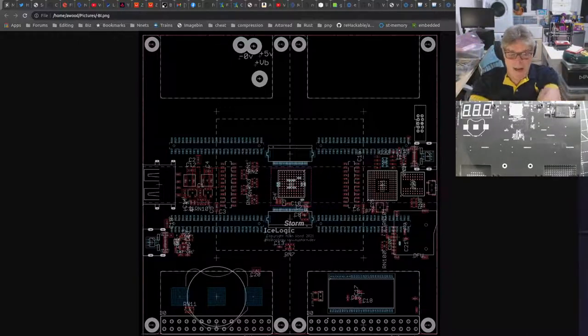And yes, we could have LEDs connected to one of those. The serial out, I think, is probably best. It would also flash when we're programming it, because the ICE40 outputs anything it gets on its input delayed by a byte, I think it is.